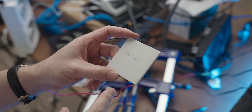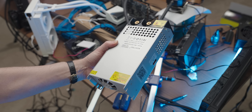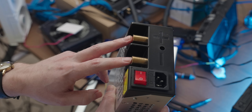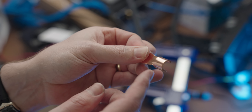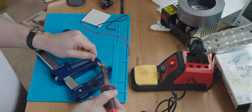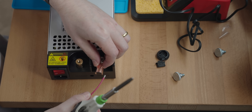Because this very powerful Peltier is just going to wildly overload a Molex connector, I'm not going to use one. Instead I'll use this IED of a desktop power supply I bought on Amazon — apparently it's a thousand watts for about 70 bucks — so this will be much safer. The little Peltier cables won't go straight into the terminals, but it came with extension bits. I initially tried to solder the connector to a massive piece of copper like some kind of idiot, even using my de-solderer to heat it, which very much didn't work. Then I realized I could just screw them down on top of the cables — that worked much better.